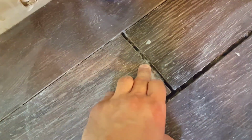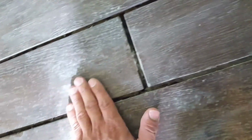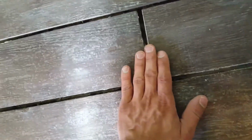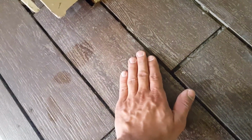Definitely right there. We're going to want that, especially stuff like this where you can see thinset will come up through the grout. Little spots like that. This part is tedious and irritating, but it is a necessary part of the game. So once we get this all cleaned up, don't skip this step, because otherwise you'll have little gray stuff sticking in your grout. And it'd be quite a shame to just start getting sloppy now.